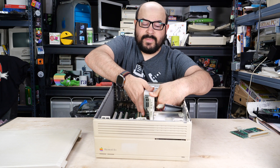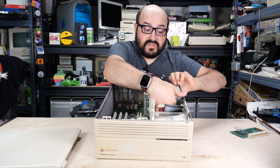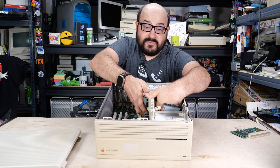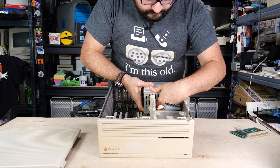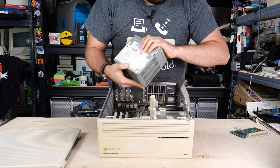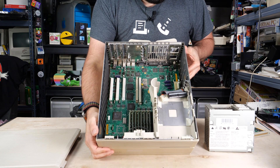First, I'm going to work on the power supply. This lifts up, although the connector can be seated quite firmly onto the logic board. But once this power supply is up, it'll give us access to other things that we have to remove. And that is a Delta Electronics brand power supply, and you can see the rest of the machine is right there.